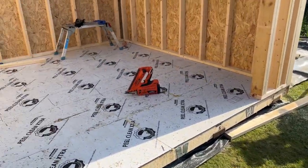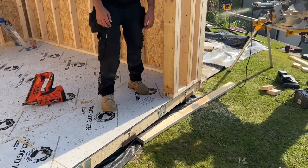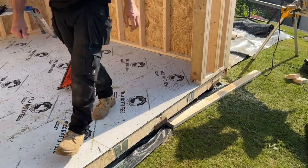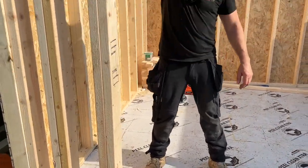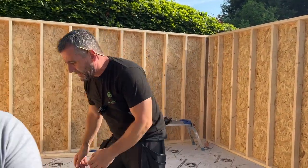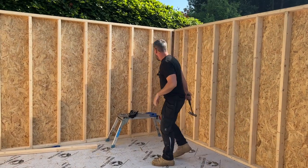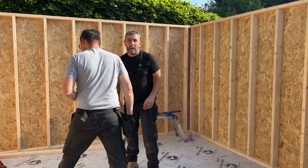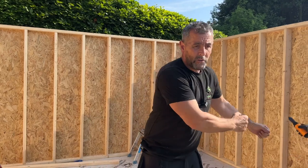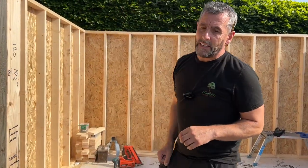We need to make sure the walls are running straight — to exaggerate, one could lean one way and the other could lean the other way. We need them dead straight with each other. John will show you how with a string line. Once they're dead straight, plumb, and everything is right, we can put the steel on and the front of the building will run through. A lot of garden room companies aren't using steels above doors — some aren't even using double timbers. When you put bifold doors in, any deflection from snow load will cause the frame to dip, and your doors won't operate correctly. That's why you want a steel above the door.